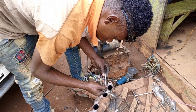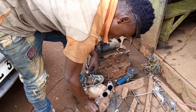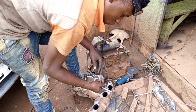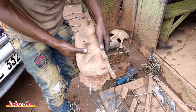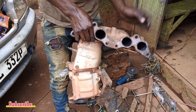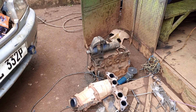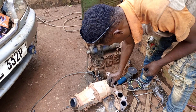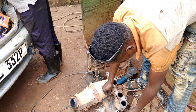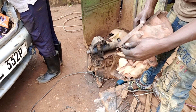Now we are done with the drilling. This tap is 12x1.25 and it passes through very well. You can see the die and drilling bit passing through cleanly. We have drilled all the holes, and on the other side we also increased the size of the bolt hole. The 12x1.25 bolt using a 17mm spanner passes through very well.